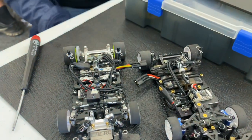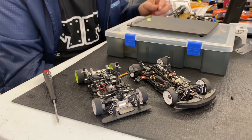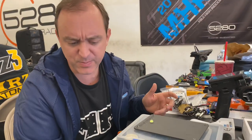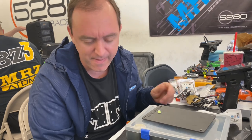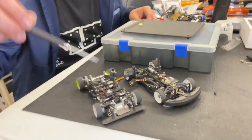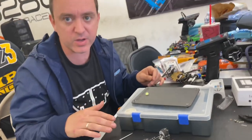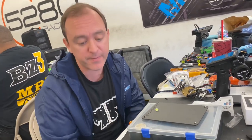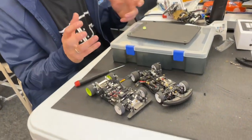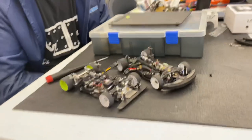When you're running super stock you may come up with a car with a Lexan Jumarama body — a Lexan roof — that is going to be right around 160 grams. We've gotten them down to 158 or 157 depending on your electronics and wiring. If you run like a plastic KCSC it's going to be even lighter, so you can start actually adding weight underneath. We have plans for a solid brass chassis for those that want something heavier to weigh down the car and make it stay flatter. Our options are made so people can tinker, but they're going to be options — not needs.